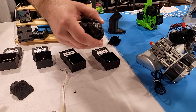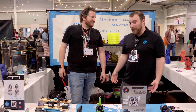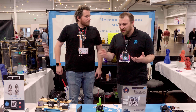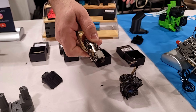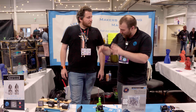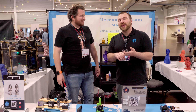Everyone has a cabinet of failure, and if you don't, you're just too new to the industry — give it time. So when we wanted to make a hot end, I don't want something I just take off and throw away. We have a cleaned-up tube that was fully encased in plastic. All we did is throw it in the grill, let it cook off, put in a new heater, and it's back in production. Don't do that on grills you use for human food — it's an annealing and heat-treating grill, non-food preparation. Mark it with a sticker.